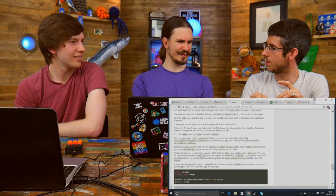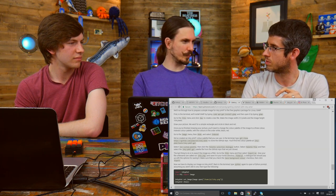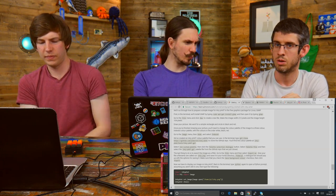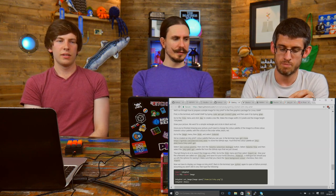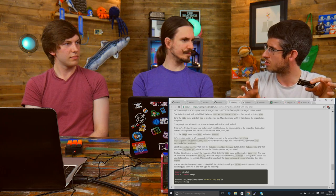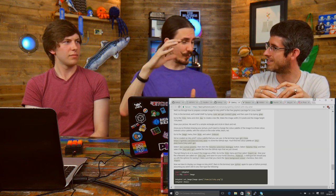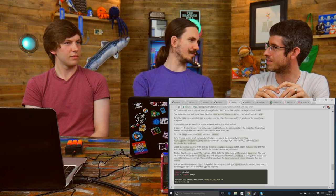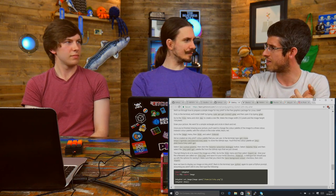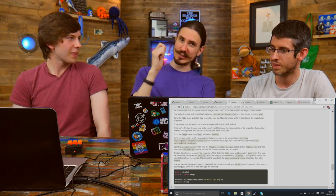Because that seems odd. But imagine the board, the PCB, and all the components act as an antenna for interference and stuff, which can certainly cause weirdness. So it's probably just either voltage kind of leaking out. I guess it must be leaking in. It's still ink in a liquid capsule, so basically a whole bunch of factors can move it around. It's not fixed per se. Temperature affects it as well. Yeah, that affects the refresh rate. I guess if you warm it up and give it a good shake.